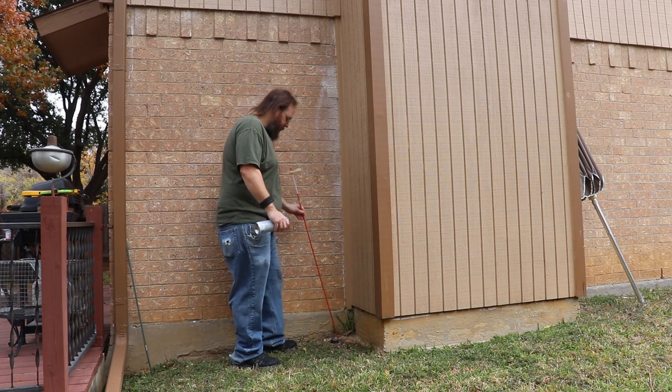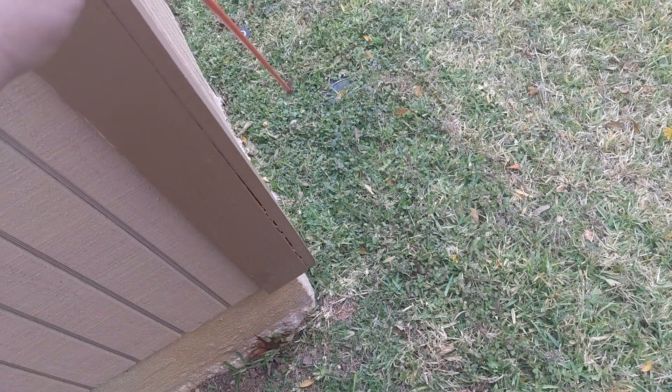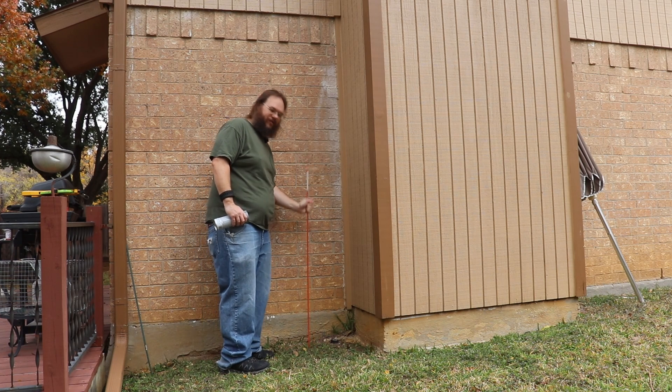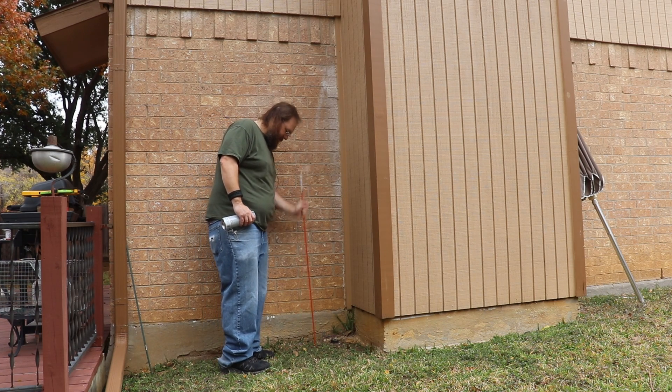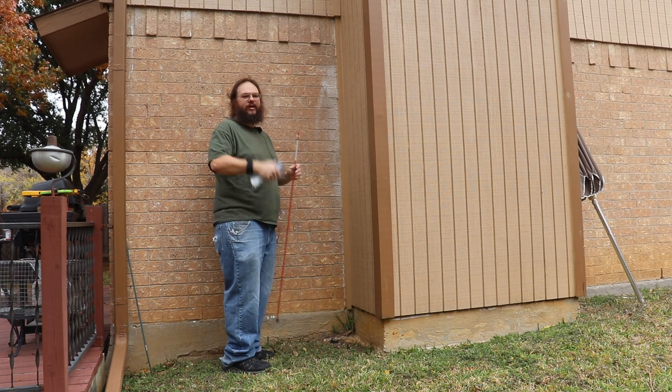Using this first right-angle corner, I did some quick math using the Pythagorean theorem. I came out to the first grounding rod location: after coming up to this corner behind me, it's going to be installed 15 feet in that direction. There's a sprinkler head here, and my sprinklers run around to this junction point — so my first ground installation is going to be right here. Man, this ground is hard. I should have done this weeks ago when it rained for three days straight.